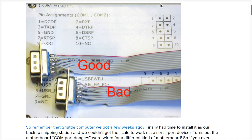If they were counterclockwise, then it would match this D connector and everything would be fine. But if you never heard of the phrase design for manufacture, and then you were tasked with the job to assign which wire goes on which pin, you might decide, oh, let's do this in an orderly fashion. And you'd pick this top scenario.